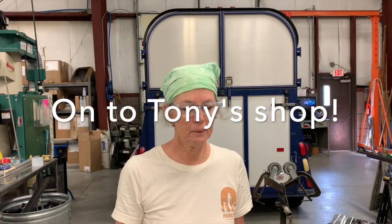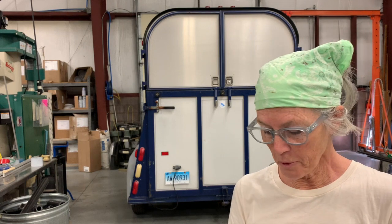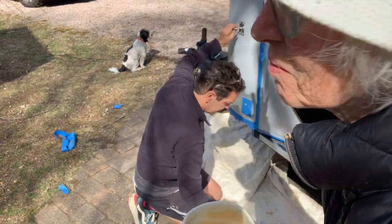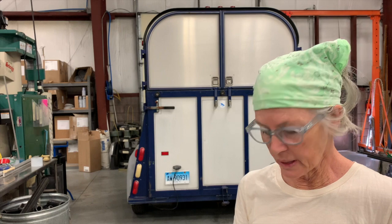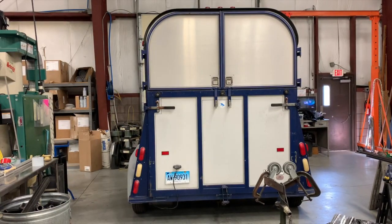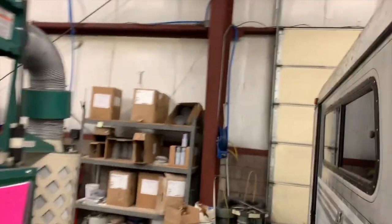Kind of back to the beginning, we had some failing spots on the aluminum primer paint. Apparently painting aluminum is kind of tricky. So I started this job and what was the word that you used? Rugged? You said it looked kind of rugged. So we're gonna tape off again and we're going to reprime and then within an hour we'll be able to put on the actual paint color.